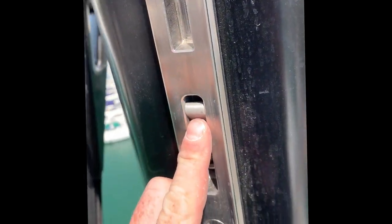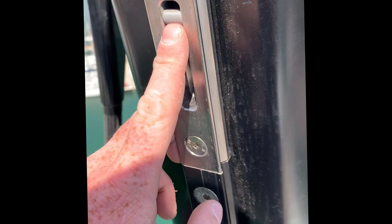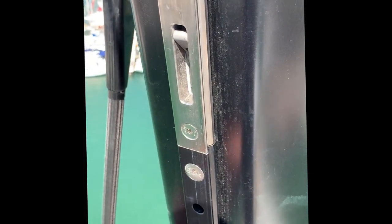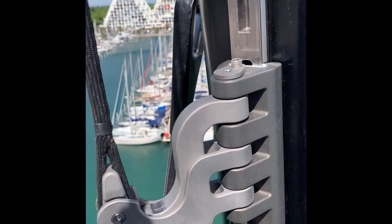With the activator mechanism it was really important that we had some built-in safety measures — primarily this little flipper that flips in and out. We needed to make sure that if the lock was not to lock properly for some reason, the flipper would move out of the way. Also, if sail geometry meant we were lined up — say on first reef and the second reef batten cars were over this piece — it needed to be able to move out of the way if required. So the flipper is effectively a spring-loaded safety mechanism inside, which cleverly allows it to move out of the way if overloaded by a certain amount.